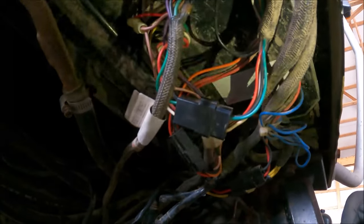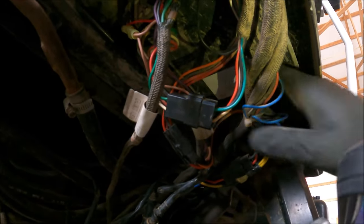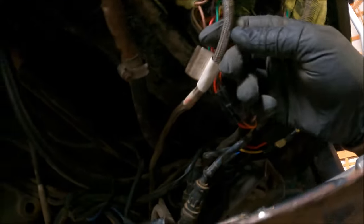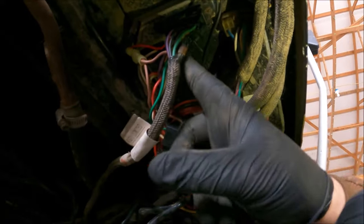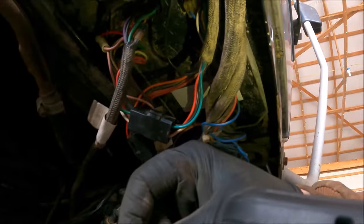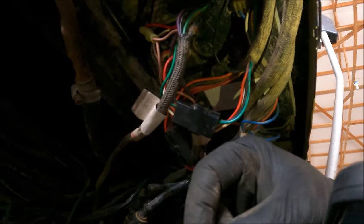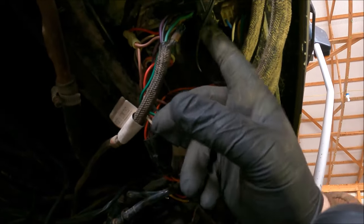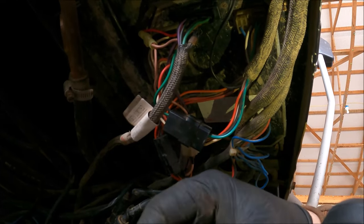I don't know how well you're going to be able to see, but right here is this computer board, if you want to call it, and there's different wiring on it. Well, this particular one right here, this plugged in, we finally figured out that one of these wires or two of these wires that were kind of together, when we wiggled it ever so slightly, you could get that light to go on and off. So we thought, okay, it's in this plug. And we thought, well, we just need to replace that plug.